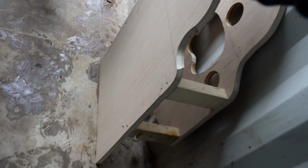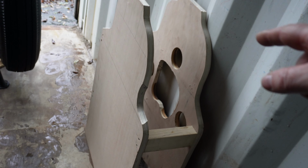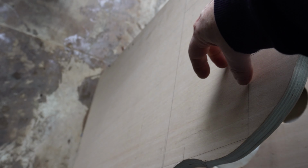I've got the alloy panels back from the laser cutters to weld together this tank. This is a model of the tank. So what I've got to do is put the model tank in here, in the hole made for it, and then mark where I want the hoses to be, because I'm going to have to cut holes and weld in ports. So you don't want those in the wrong place. They've got to match up with the two lower ones in some way.